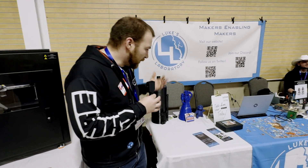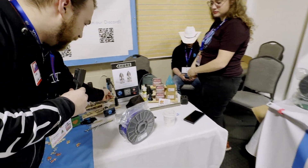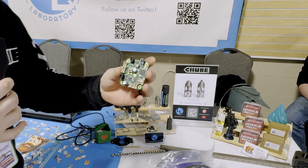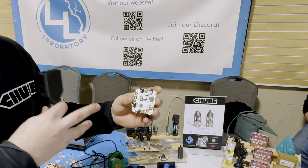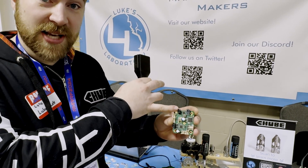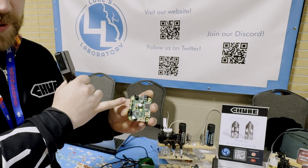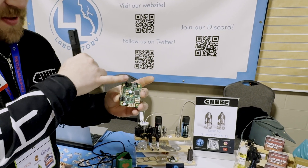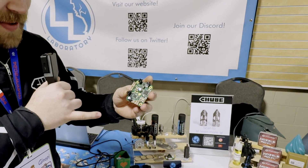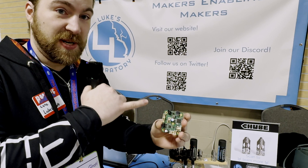Moving down the lineup, we have one more really cool new thing — it's a bit more of an alpha build. This is a 48-volt tool head. Not only can you do 48V on the extruder to get more speed, but it's also 48V on the heater to cut down on the current you're sending to your board. A cool trick is that it has a beacon pass-through port, so instead of running two or more USB cables, you connect a single header and it powers the beacon directly. It has three 12V fan ports including tachometer and a separate PWM signal.